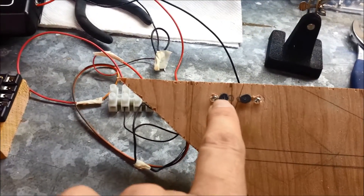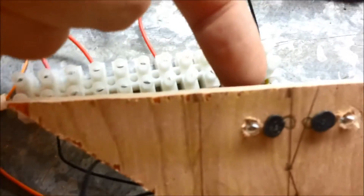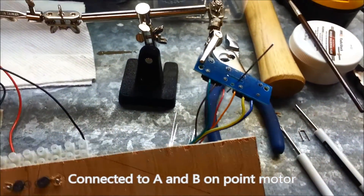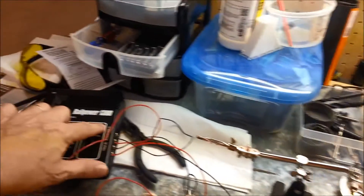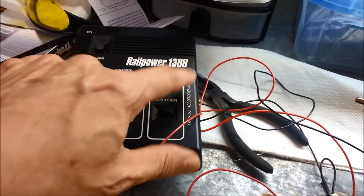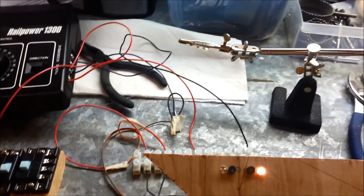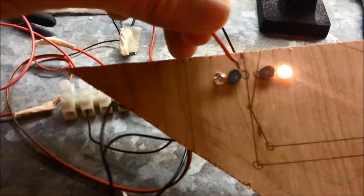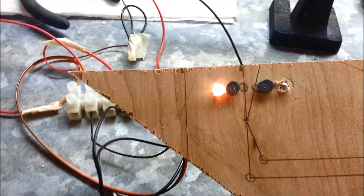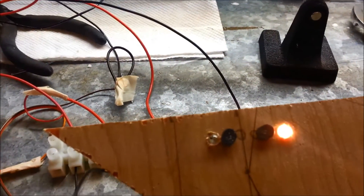What I've done is I've got a couple of carpet tacks as my studs. On the other side they're wired up to the connectors on the point motor, per the handy dandy diagram they give you with it. That runs back to my AC power. Right now I've hooked DC power up to the light bulbs, and the result is the light is on, currently indicating the point is set to the right. I come along with my pen and touch the other side, and now the other light is on indicating that the motor has flipped the other way — there goes the motor and there goes the light.